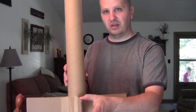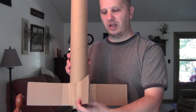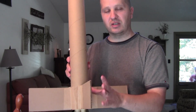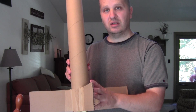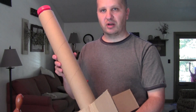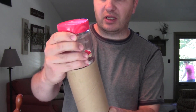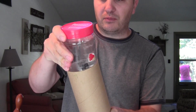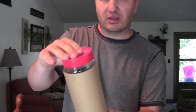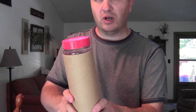The fins are just corrugated cardboard — I laminated two layers of corrugated cardboard together and used that for fins. These probably won't last; if this thing survives the first flight I'll probably switch them out to something better. The nose cone is also something I rigged up. Believe it or not, it's a peanut butter jar with the bottom cut off, and it just happened to fit perfectly in there. There's a little lip right here that catches, so it works out really well.